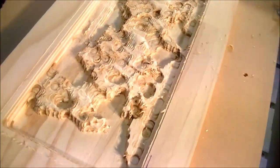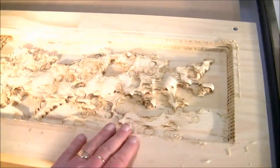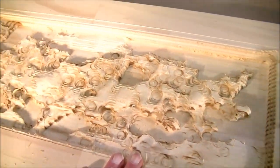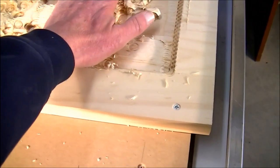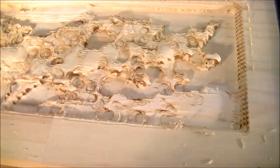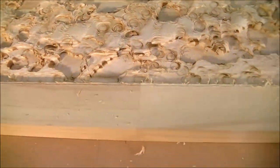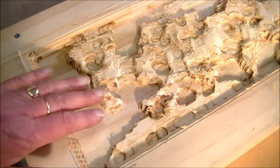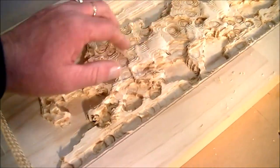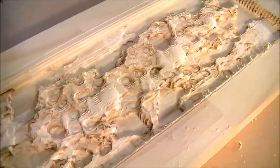What I wanted to show you is that this machine, equipped with servo drive, can do a roughing cut, and bear in mind this is a cut of 16mm in depth. That's what, 5/8 of an inch or something like that. And the big thing to note here is the distinct lack of burning. It has discolored the wood in places, as you would expect.